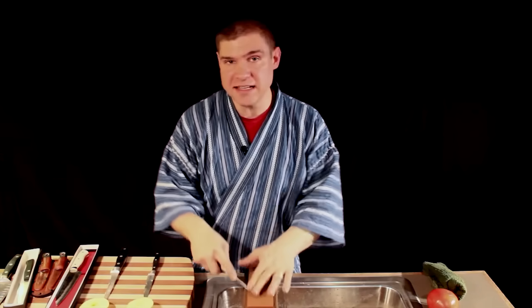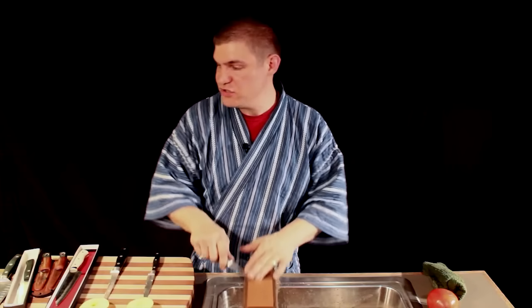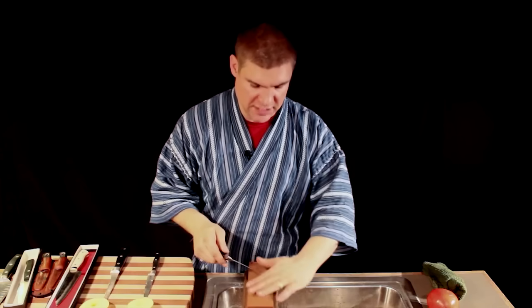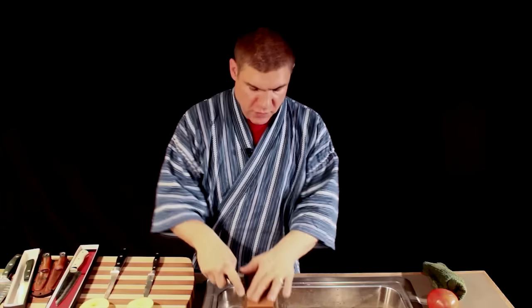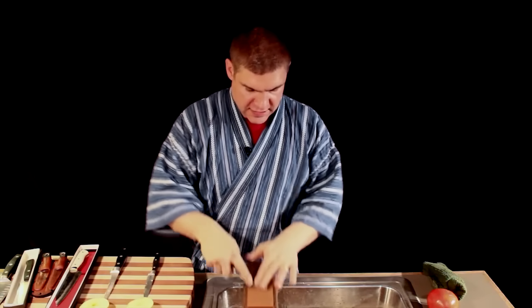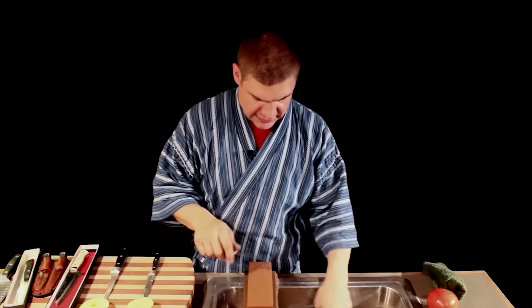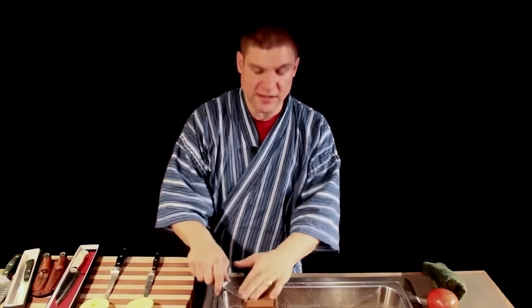And just like that long slicing knife that I was sharpening earlier, that seemed to be really sharp in some sections, and there was one section that I just couldn't get to be razor sharp. You know, heat is the culprit. Just like an apple pie, everything's time and temperature. You cook an apple pie in the oven for too long at too high a temperature, no one's going to want to eat that apple pie. When knives are being made, it's also all a factor of time and temperature. And if the steel is ever heated up past a certain point in either the annealing, quenching, or tempering process, you're going to negatively affect the performance of the steel.